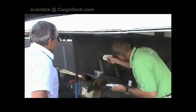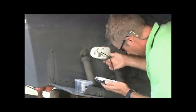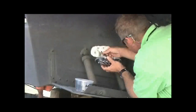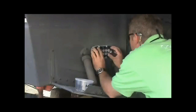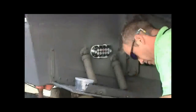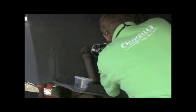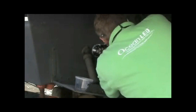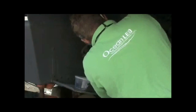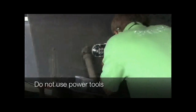We're going to come over here to the boat, take the power wire, and feed it through the hole. These lights come with a six-foot cable, so any problems you have on the inside with extension wires are pretty much solved. Very simple installation — just push the light against the hole until it seats properly, take a number eight pan head. Now there's a time and a place for power tools, and this isn't one of them. You want to use a screwdriver and just hand-tighten these lights. You don't need a power tool or a drill — get on these too hard and there's always a possibility of cracking the light or going too far in.